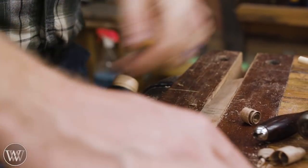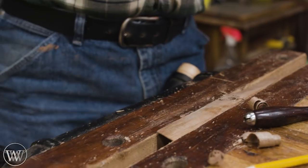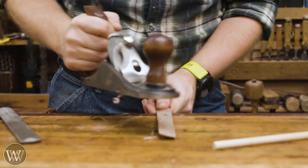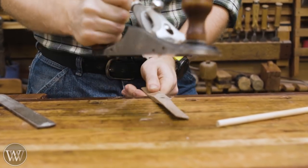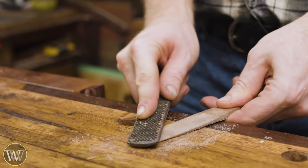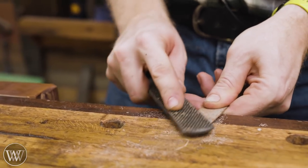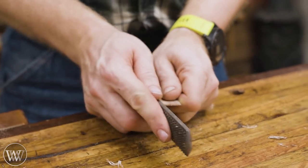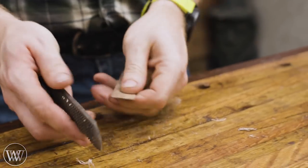I drill the hole partway through until the auger comes out the other side, then turn around and finish the hole so I get a nice clean finish on both sides. I take off the pencil marks with the plane and file everything smooth. There were a few marks from the spoke shave I didn't quite clean off, so a file is a little easier than a card scraper. It also gives you the chance to round over the corners, making it a little safer for the kids so there's no sharp corner poking them when it spins around fast.